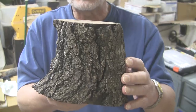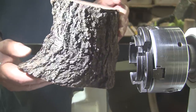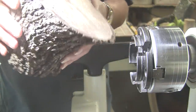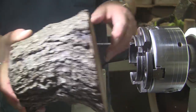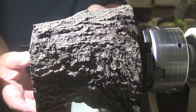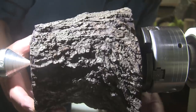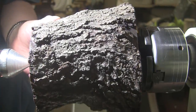I'll show you how I decided I'm going to solve that. The reason I'm doing it this way is because I want to keep the bark on the bottom, not necessarily on the top. So I don't want to take much away from the bottom. I'm going to put the bottom simply against the jaws — nothing else is going to hold it. No center, no woodworm screw, nothing. It's just going to sit there. The reason for that is because I don't want to be pinned to a particular point. I just want to look over here and see when I feel like it's centered.